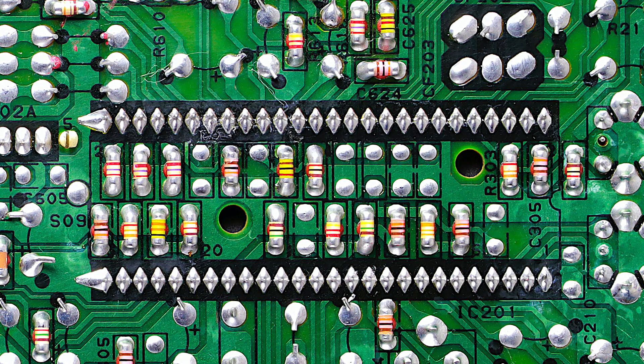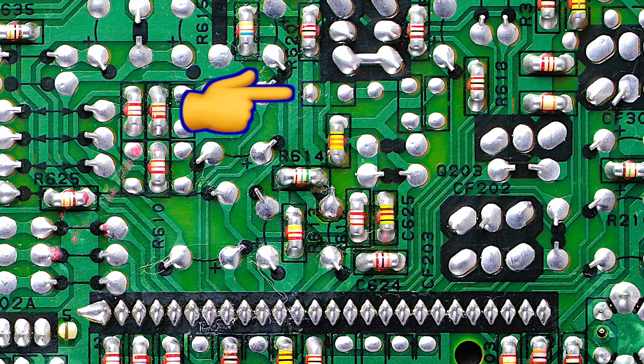Looking at the bottom side of the board at the chroma chip, insert the sync signal into this point — this point also doubles as the composite video input. Now, build this circuit that inserts into the left side of the jumpers that lead to the chroma chip as indicated earlier. Notice the 75-ohm terminating resistor leads to a voltage divider.